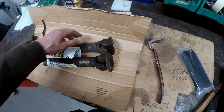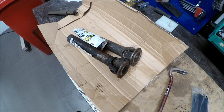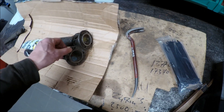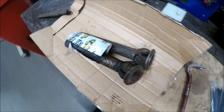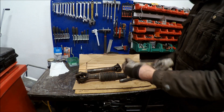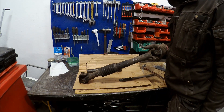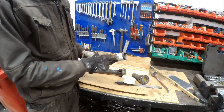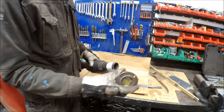Today I received a package with parts for the cardan axle — these are the small flanges that fit the Lada Niva transfer gearbox. Now I'm going to pair these to the TGB-11 cardan axles, which are the bigger-sized flanges. Hopefully this outer diameter fits the inner diameter of the cardan axle from the TGB-11. Well, sometimes you are really lucky — look at this — outer and inner: perfect fit! A good tip: if you want to cut a tube as straight as possible, use a bit of tape, tape it around, and at the intersection it should be a straight line — then you have a perfect cut.